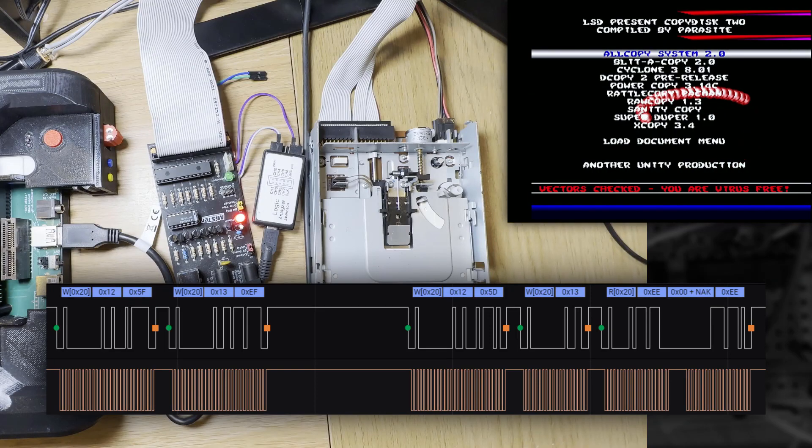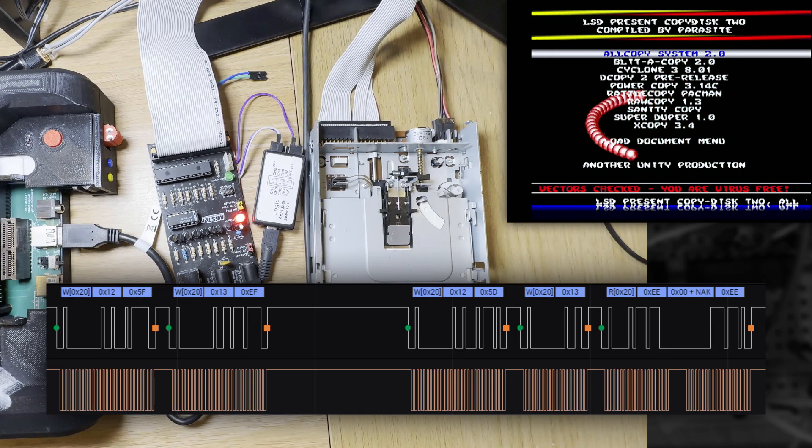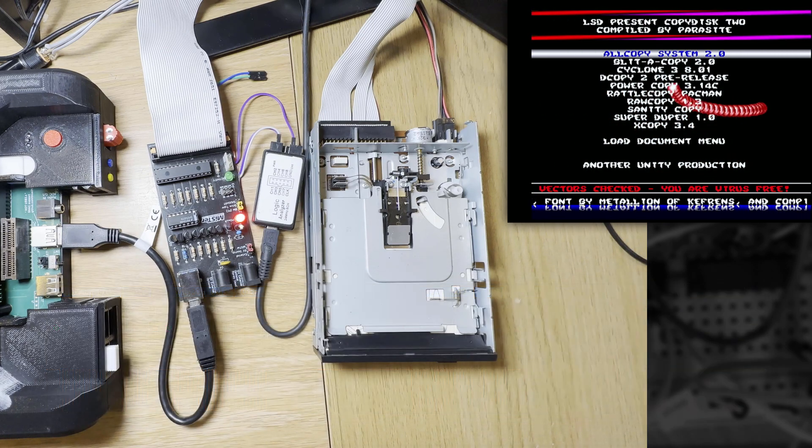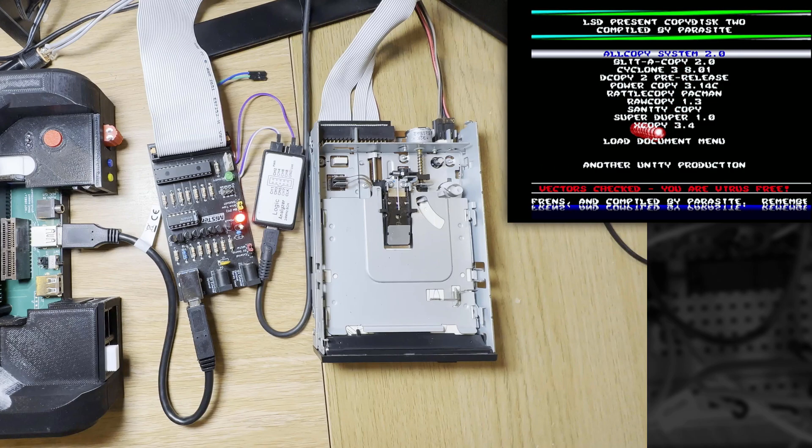This is the I2C data coming into the port expander, and I know the cause, although I haven't figured out how to fix it yet. This doesn't matter however, as I've changed the pins from the port expander such that the problematic pin is now only triggered when using drive 3. Are you really going to use 4 drives? Someday I'll fix this though.